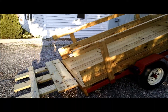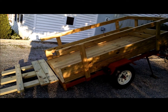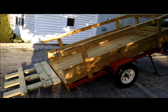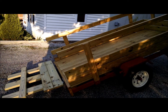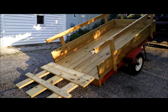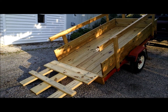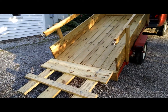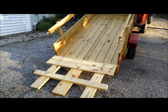I had originally said that I was going to put pressure treated decking on, but after I looked at the selection of pressure treated decking at my local hardware store, it just didn't seem to do it justice. So I decided if I'm going this far on it, I'm going to go all the way. I ended up putting the five-quarter decking down and using Minwax Helmsman's semi-satin, and coating the boards twice.